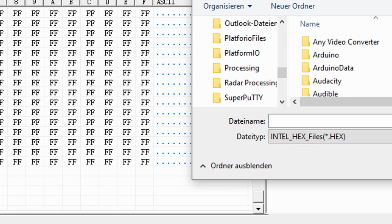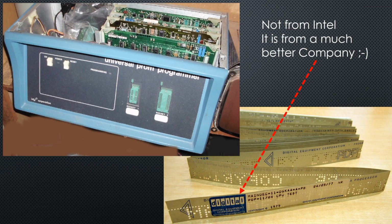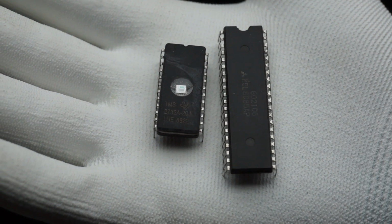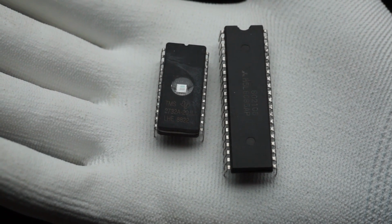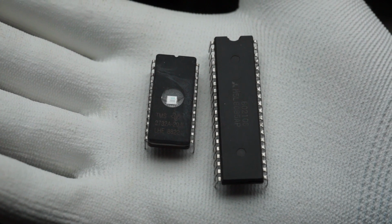How were these programs stored and transported from the development machines to the standalone programmers? With Intel hex files. These were invented when the programmers still used punched paper tape to read the code. We can always use this format today, and I think it still has the biggest compatibility list. Now we have a CPU and memory to store the code. We can even erase and program our historic chips. Now we can start to build our computer.